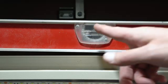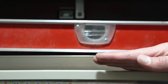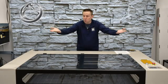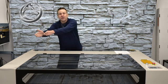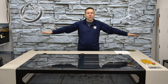I've got the bubble going all the way towards the back of the machine, which means the front of the machine needs to raise up to bring that bubble over to the center. All I need to do is raise the front of the machine, and just like before, when I add quarter turns to that leveling pad in this corner, I'm going to add the same number of quarter turns to the other side to raise the machine evenly so we don't throw the level out in this direction.